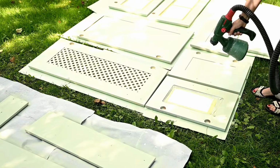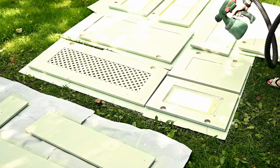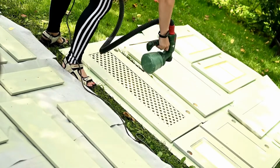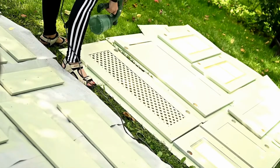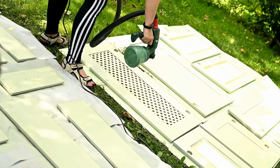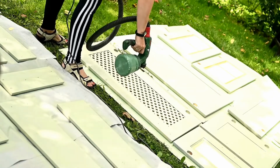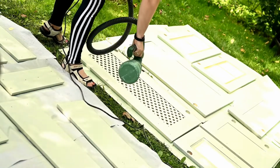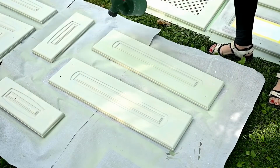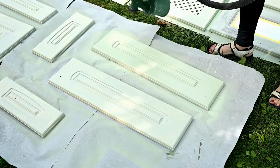I also want to talk about a very popular type of coating. This is chalk paints. Well, right everywhere they are advised for painting a kitchen, which is really once and for all, quickly, easily, no need to prime, but I would still treat this option with great caution if I were you. Chalk paints are very thick, they are quite difficult to apply evenly, especially without experience, so you'll get brush strokes, layers, bumps, all that kind of thing.